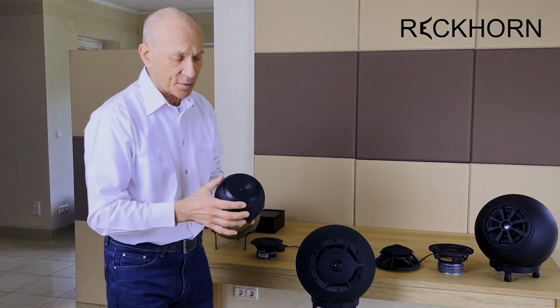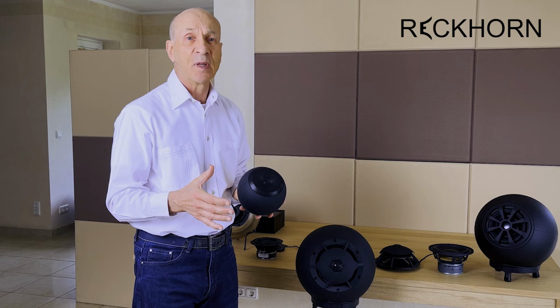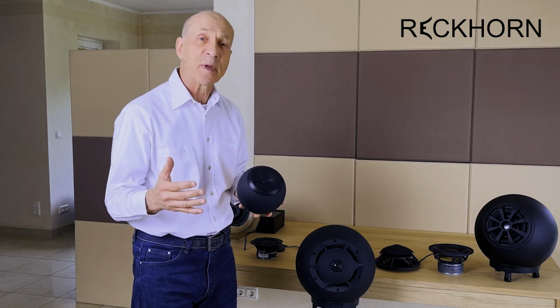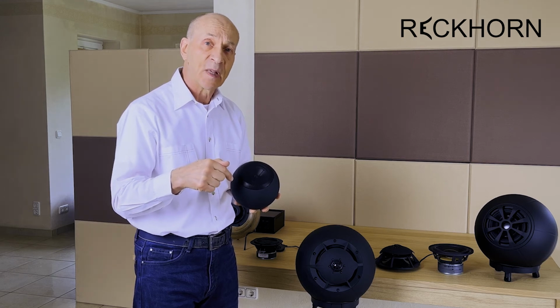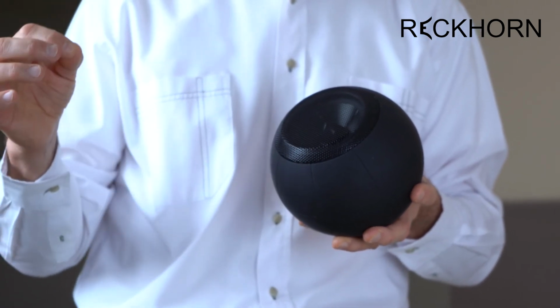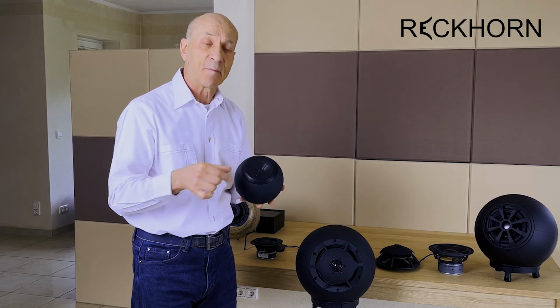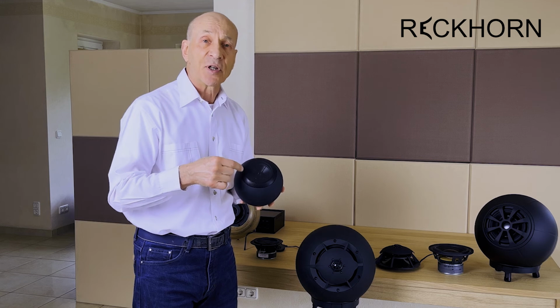The speaker inside is a 4-inch full range speaker, and what is special here is an aluminium diaphragm, which is very stable, but naturally aluminium has some resonances. What we do to reduce them is cut 5 lines into the diaphragm. Then it goes into the coating to make it black, not for good looks, but to make it harder. And then we close the lines with a very soft plastic material which dampens the resonances. And all these 5 parts of the diaphragm are non-symmetrical. So the remaining resonances of the parts here are just 20%.